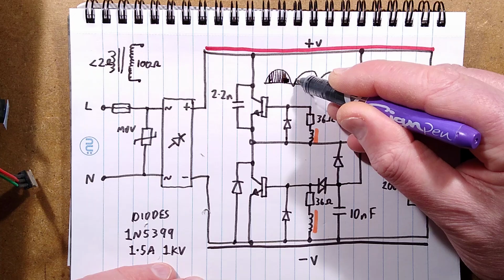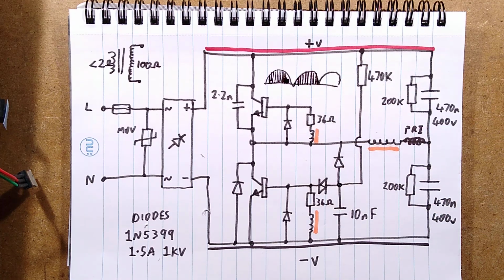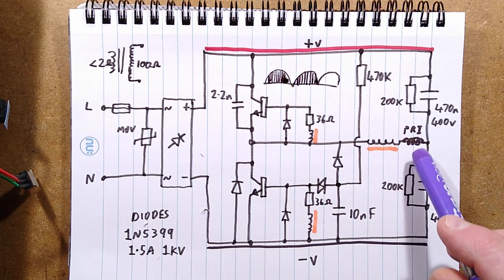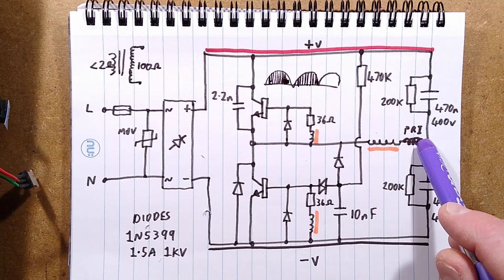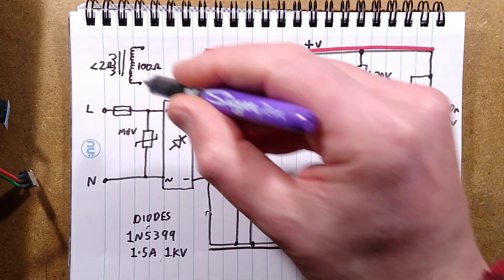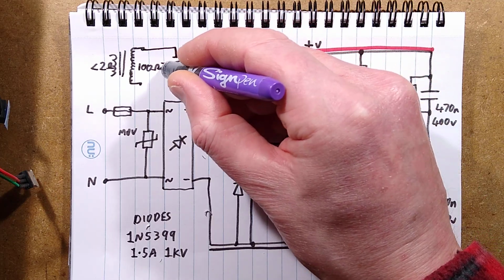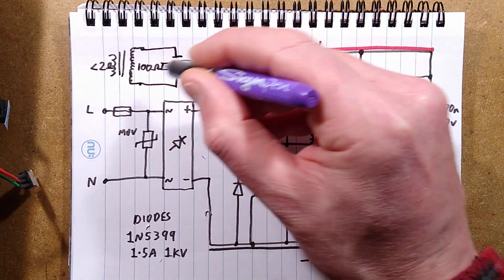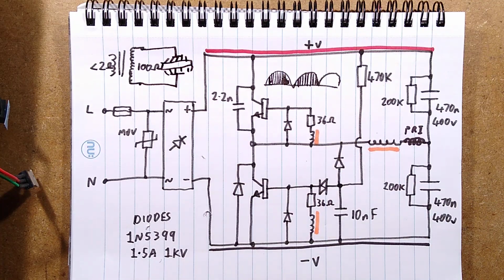And then at the start of the next half wave, it will trigger again, and then it will start running as a series of spikes across that. And that is fundamentally it. The high current alternating positive and negative pulses through the primary induce the high voltage in the secondary, which then goes across that insulated plate, the ceramic plate, and that creates the corona discharge in that area, and that creates the ozone.